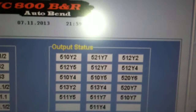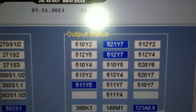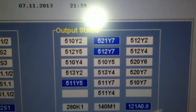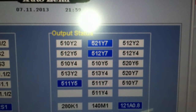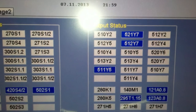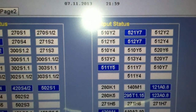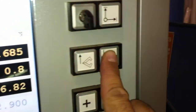Now, what's really interesting, it's the same thing when I use the push button to make the upper beam go down on the control. That module back there says 514, but in my outputs there's no 514 on the screen anywhere here. And when I press the button to make it go down, 521 and 512Y7 light up. I cannot find a 521 or a 512 on the machine. There is a 511Y5, which is the directional for the upper beam to come down. And as you can see, my push buttons over there, my channel 1 and 2 are working for my push button here.